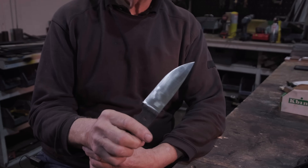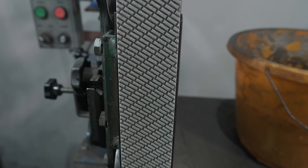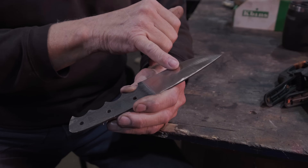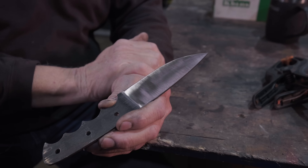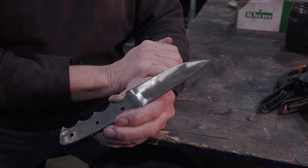What we have here is a knife I'm going to show you how to hand sand. This finish has been done on my belt sander — it's a flat grind, taken down to an A45 gaiter belt, equivalent to about 400 grit. There are a few principles about hand sanding you need to understand. When I go on to hand sanding now, I'm going to start at 220 grit — just a little bit coarser. Machines seem to chow into your metal much harder than hand sanding does, so you come back a grit to make a start.